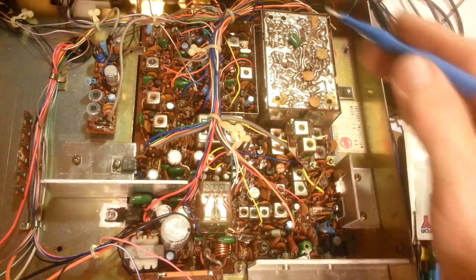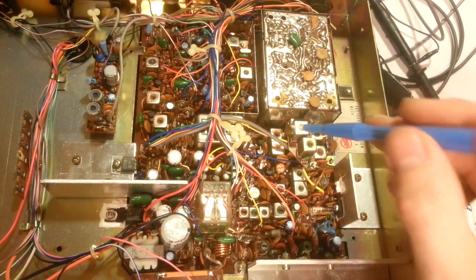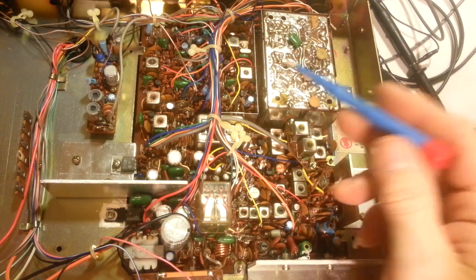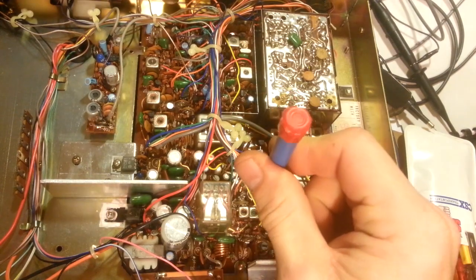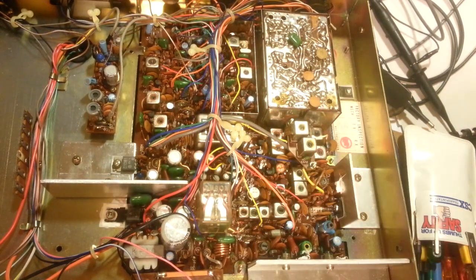As far as finding the bad joints - have fun. If you go through and test and find a bad joint, that's one thing, but if they are just everywhere like on this board, it's an extremely time-consuming process. It's not like there's a flag on there saying 'hello I'm a pass-through' - you've got to find every single one on the board and address it. So yeah, it can take a lot of time. I'll contact the customer and we'll see what he wants to do with this.